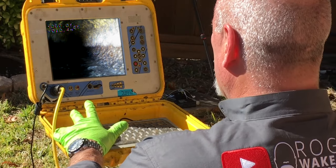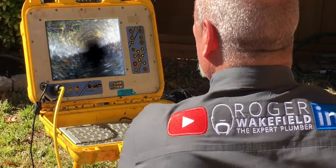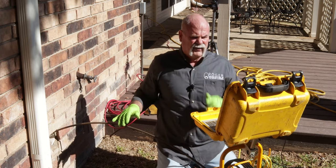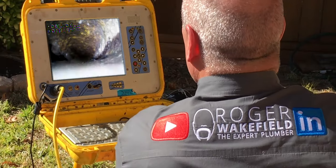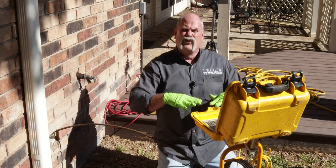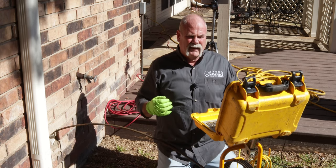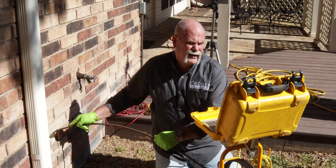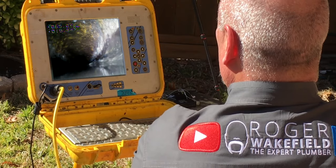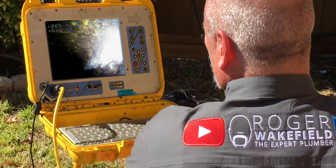I've got one clean out right there, and I'd be willing to bet if we keep looking we find another one nearby. Coming back in slowly to look along the top for any visual confirmation of clean outs. There's a fitting visible on the right side, and water is floating — I believe that two-way clean out has dropped down and is holding water. I'd be willing to bet the sewer water test is probably not going to hold. Looking at the top of the pipe, I don't see any lines on the side where clean out fittings could be pointing up.